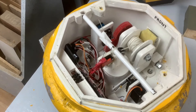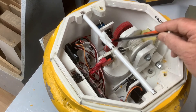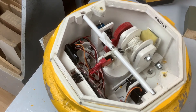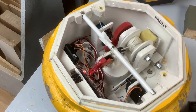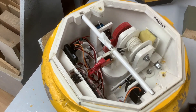So first I'm going to let the anchor drop. This little servo here is going to raise this arm and the mesh between these two gears will break. There's the anchor dropped. I'll lock it back down in place — that stops it spooling out any more. If you're on the water you've now anchored the mark, and it's locked with a brake on that particular ESC so it won't drift. Then when we need to bring it back up we just use the winch button and that activates until it gets to the top and then it switches the servo off. That's the way it works, and it's just done a great job for us.